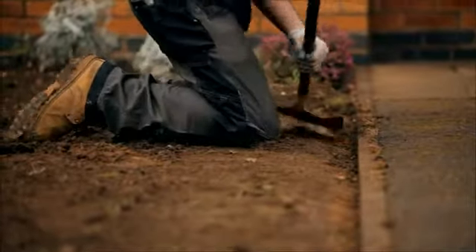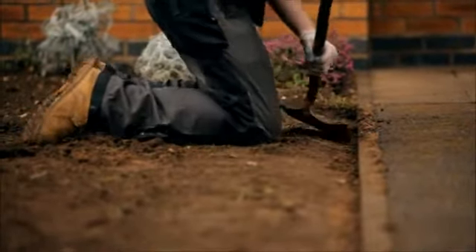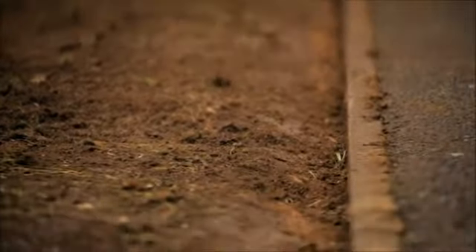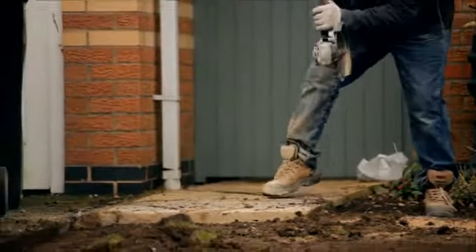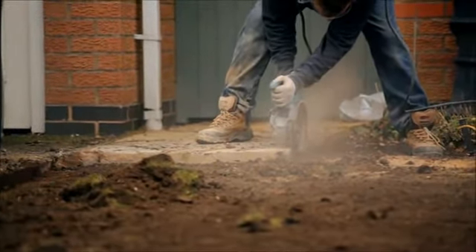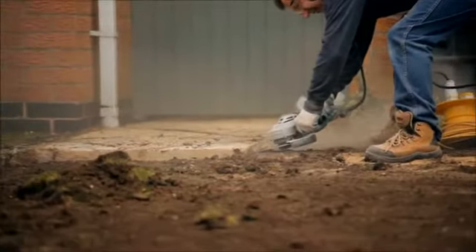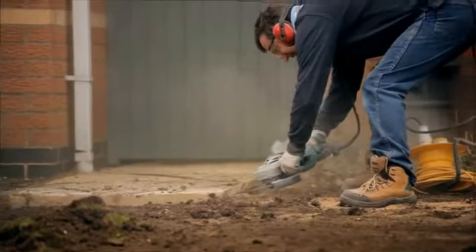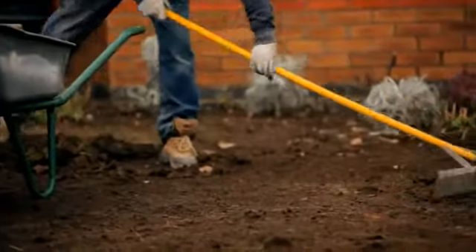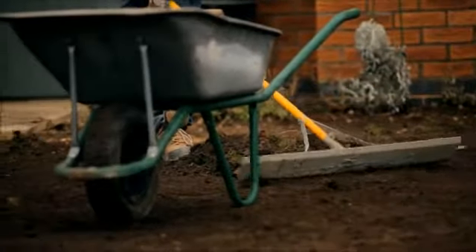Using a sharp spade, create a chamfered finish at the perimeters, set approximately 30-35mm below the perimeter edgings. Cut back any haunching that is too high, as a clean edge is needed to butt into. Using a rake, level the area off to natural falls, as you don't want humps or bumps prior to installing the stone base.